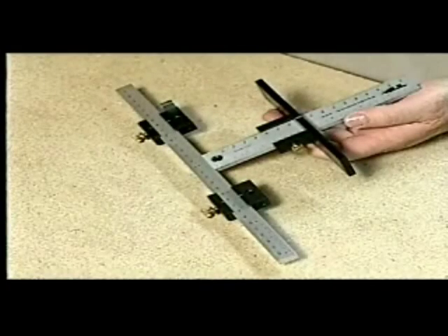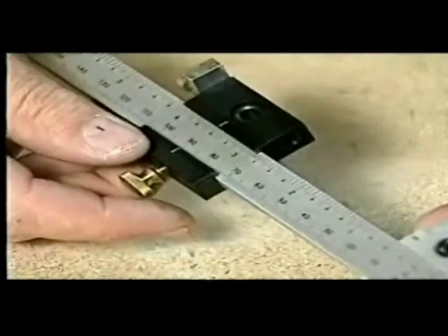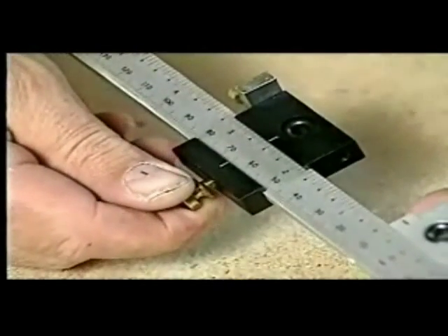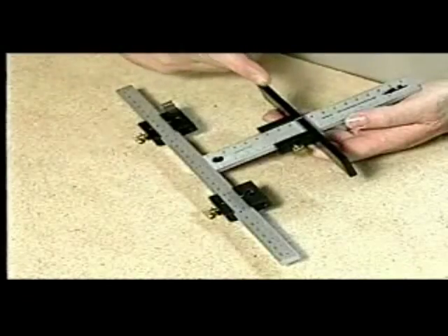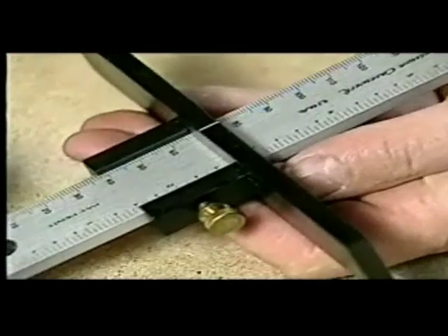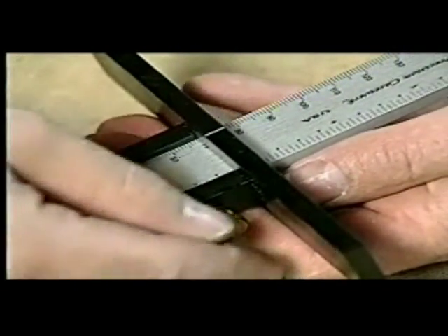The True Position Drill Guide is basically a T-square with a fixed drill bushing in the center, or zero point, of the scales. The drill bushings on these sliding guides are in line with the central fixed bushing. Using one of the indexes, you can position these guides from your choice of either English or metric scales. This top stop allows you to set the distance between the edge of your work to the center of the holes to be drilled. Position the stop along the scales, referencing from the edge closest to the drill bushing.